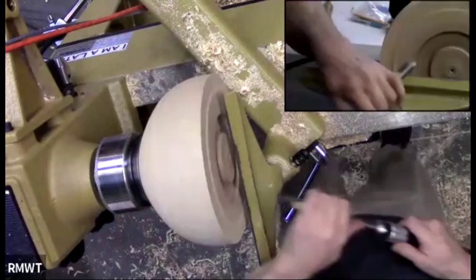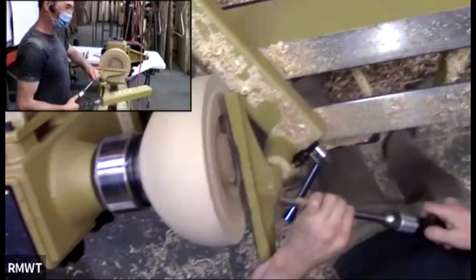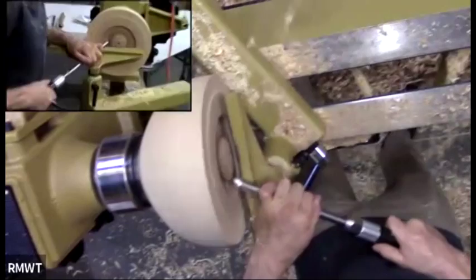Okay, so all my cuts want to go straight in. The straighter I go, the faster I can cut. If I go in a large volume like that, you see the difficulty, the vibration? That's what happens if you go towards the end grain. So we don't go towards the end grain, we go to the side grain. So get rid of it, side grain, side grain.